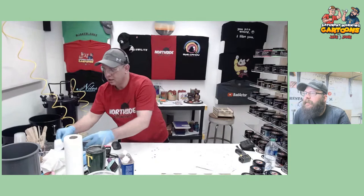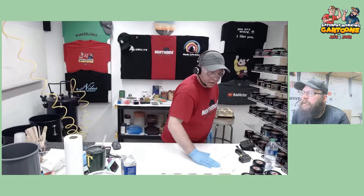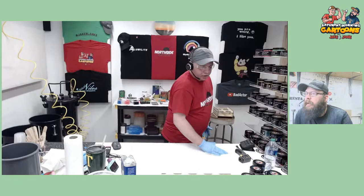Broken Branch has got a question for you. He says, I've just got my stabilizing setup in the mail. Are you stabilizing the wood for these kinds of projects? Yes. Everything that I put in here is stabilized stuff. Most of the stuff is burls, so that's the biggest reason. But you need to have it dry, and if you don't stabilize it, you need to coat it. That would probably be the best thing.